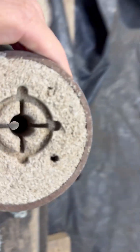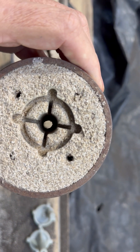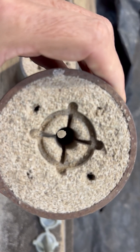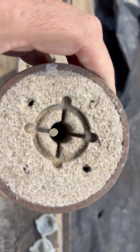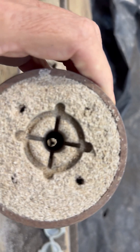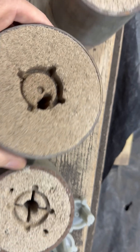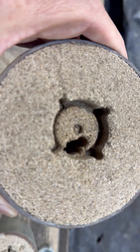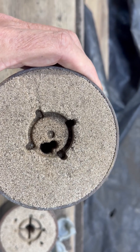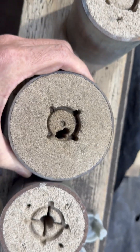Decided to go over to using water glass, or sodium silicate. The sand could be a bit smoother, but that's the hole left when we withdraw the part from the cured sand — a little finer, this sand is. That's got the little hole for the carburetor spigot. We have to put some vent holes in there.